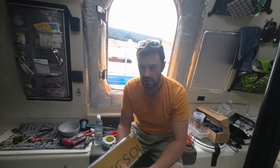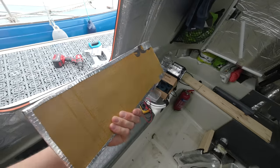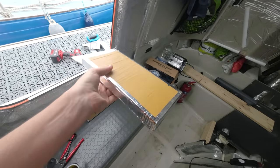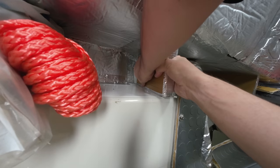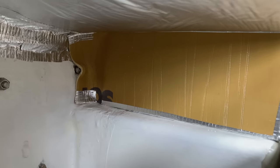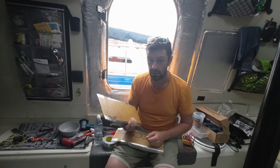If you can hear me over all the seagulls behind me, look at what I've made. I've made two of these blocks — a port side one and a starboard side one. They are simply a side block of wood and then some mass loaded vinyl mat, a bit like you have on the rest of the engine cowling on either side. They can slot using friction into those two gaps, and then I've left a floppy bit on each end — that will splay out onto the backing, because there's a slightly uneven surface on the back. So there's no point trying to match that profile; it will just press up against the foam at the back and hopefully create, if not quite a seal, about as close to one as I can get.